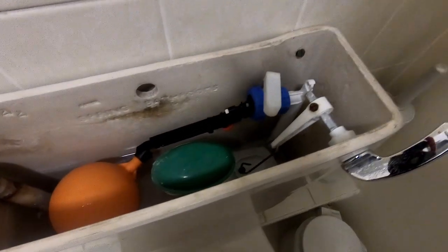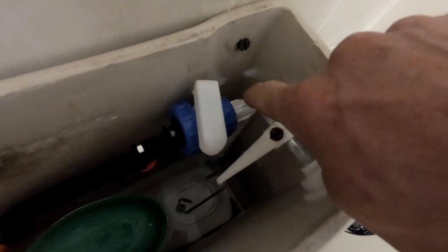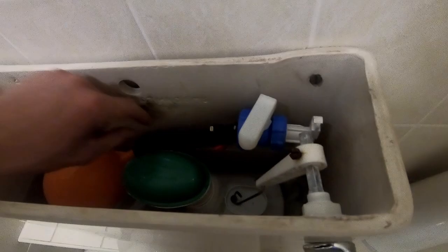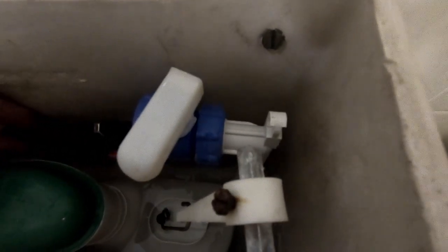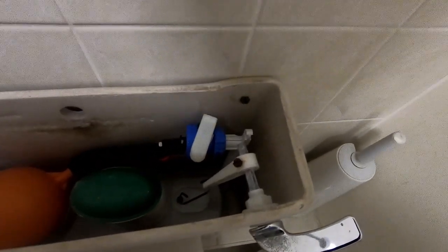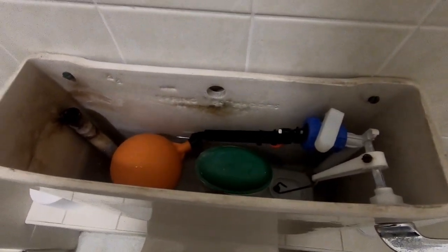Also, what I've noticed — if you look there, there should be a little threaded bar with two nuts on. That gives support for this valve against the cistern to stop it from flexing. When the water rises it lifts the ball, but if you look, the valve actually moves. That needs one of those support rods in there, so I'll have a look in the van and see if I've got one, then I'll set the water level height and give it another flush.